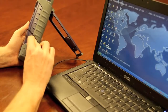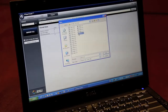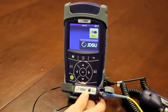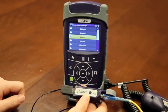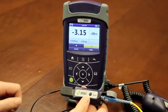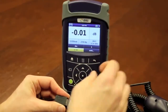You can save the data directly on the device and later connect it to a PC and use FiberCheck Pro to import all of your saved results and generate a certification report to provide proof on the quality of your work. In addition, you have the flexibility to plug in a USB optical power meter like the MP60 into one of the USB ports to add OPM capability. You can select multiple wavelengths, measure absolute or relative power, and store the readings individually or link the stored readings with your saved inspection results so that they are integrated together on the certification report.